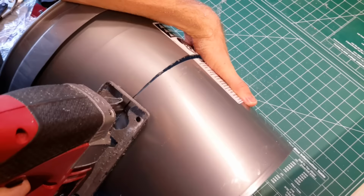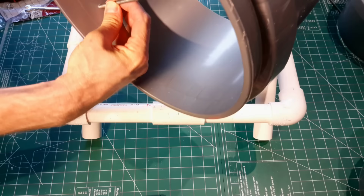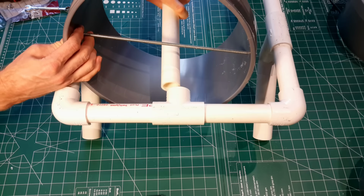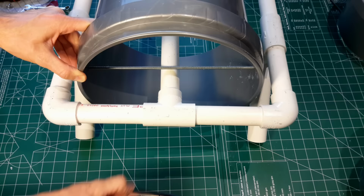Attaching the buckets to the axle itself is actually quite easy. I used the all thread, put it through the bucket top, inserted the axle through the bucket and then into the frame. I'm going to use approximately a 1 inch space on the outfeed side from the frame to the bucket and then mark a pencil line on the axle where the all thread goes across.